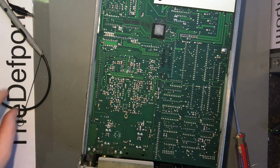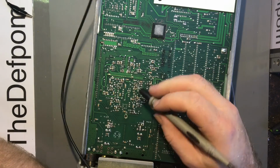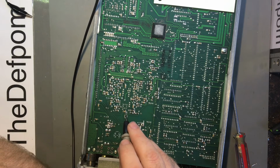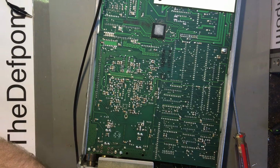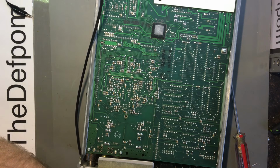What I am looking at is this little relay which does that switching. There's a bit of bare trace there. There and there, it's bare traces. And of course, there's also a through hole here, too. So, there's a few possibilities there with things that could go wrong. I don't see any burnt traces. I don't really see any bad joints. Through holes are something I'm always suspicious of because they can fail. Resistors look okay. I can't see any signs of burnt resistors or anything like that. Visually, it all looks fine.